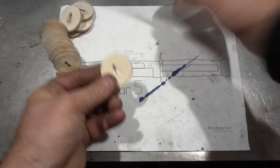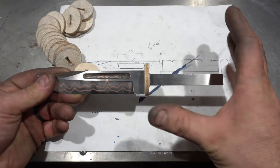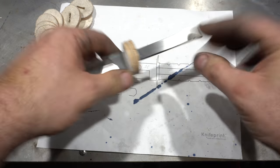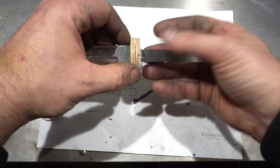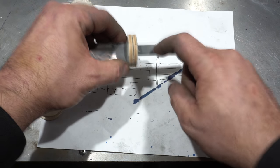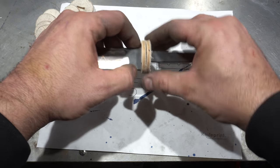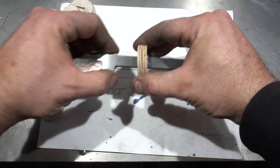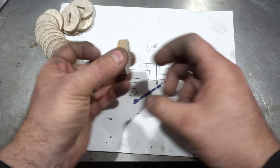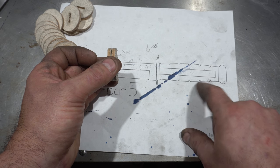I've got all the leather pieces resized so they all fit well now. I want to talk about how I'm going to squeeze these together — get all these on here, all filled with epoxy and epoxied together, then clamp them really tight. I don't want to do it on the knife because with the guard it's really hard to form them. So what I want is to clamp them down and be able to slide the handle out. Once they're glued up, I'll drill a hole through the center, put a threaded rod through, then put them on the lathe and turn that shape with the little notches.